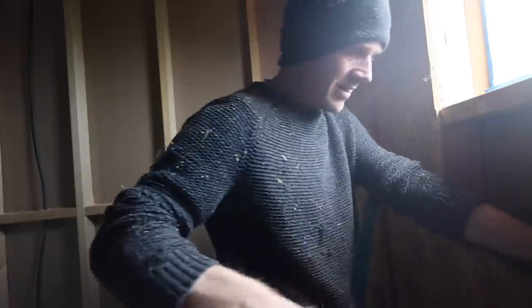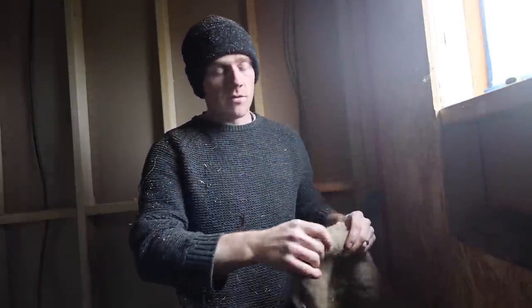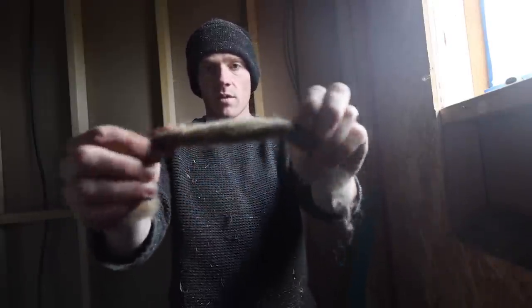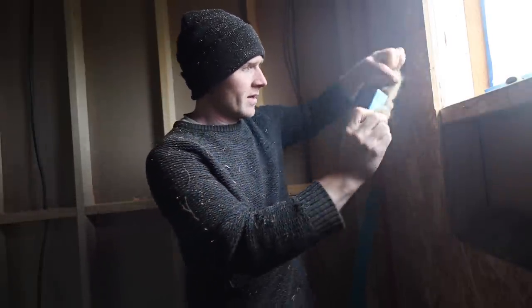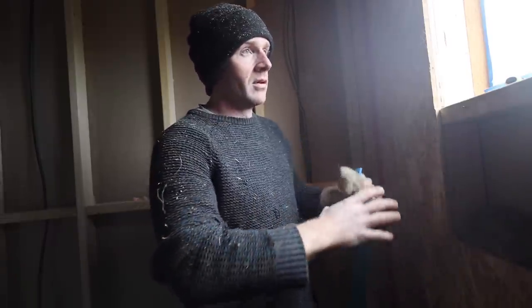I tear off a piece of sheep's wool like this — I can use that. I've decided not to get the window rope, which is the sort of insulating rope of sheep's wool that you tuck in around the window. I'm just going to use what we've got so much of around. If you take off a section like this and roll it into a loose 15 to 20mm strip, you can get that on the side of the window and with a knife or even just a plastic spacer, force it right into the back of the void and just keep filling it. Then we've got a nice, breathable, sustainable way of filling that without just jetting in a load of foam — though we might end up using some foam if the gap is too thin.